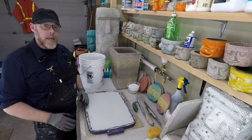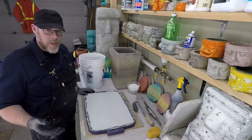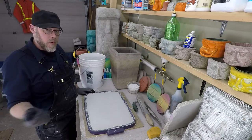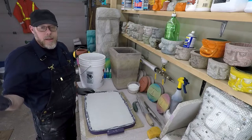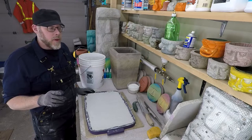So unfortunately, if you have some people doing some work and they're pouring concrete over grass, or you're in a situation where you're like, look, it would be a lot easier for me to not have to remove this grass before I pour concrete. Look, it is what it is. I tell you, you should definitely remove the grass. You will regret it if you don't remove the grass.